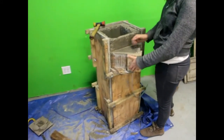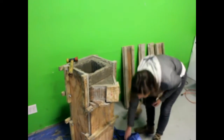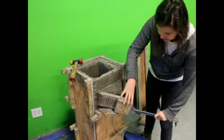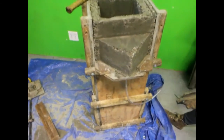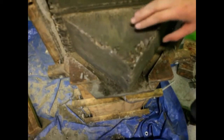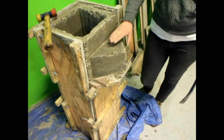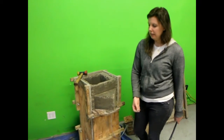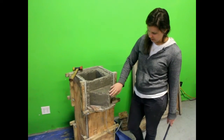The next thing is to remove the nose — I'm just going to pull this off. It should be pretty easy to come off. Remember our mix was pretty wet, so I'm just going to slowly lift this up. There's a little bit of breakage at the top here, but overall it's looking pretty good. We could fix this with some mortar — it's not too bad. There's a lot of aggregate that settled at the top, so maybe we didn't tamp enough, or our mix is too rocky. We used Quikrete on this — the ready-made concrete — which is not what we recommend in the manual.